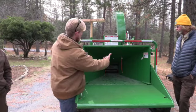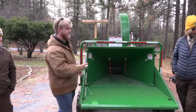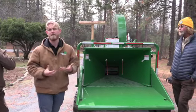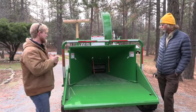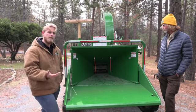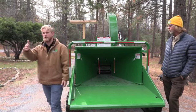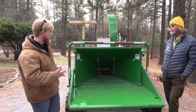Now, again, this is a 7-inch diameter, so for me, that's tough to squeeze into there, thankfully. But the bigger style chippers, as CCC also runs, the 250s, the larger style, we see a lot of deaths and accidents with those. So you need to be cautious when working around the in-feed tray. Like Mike was talking about earlier, guys, when you have your material, best practice is feed your material through, loop around, go get your next bite of brush. You do not need to stand here and watch the machine perform.